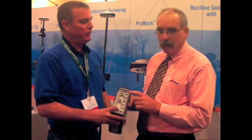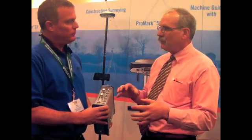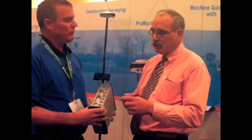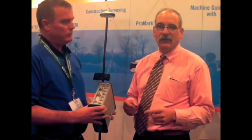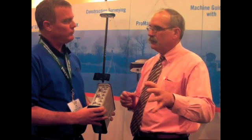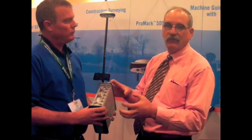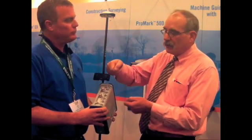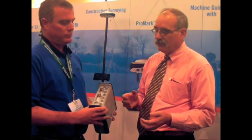Optical isolation: if you're working on a marine application on a boat, you don't want any stray currents going from different places back to the equipment. These are optically isolated, so wherever you run the wire is not electrically connected to this box. If you take an ohmmeter from these connectors to the box, it'll read infinite — no current flows.